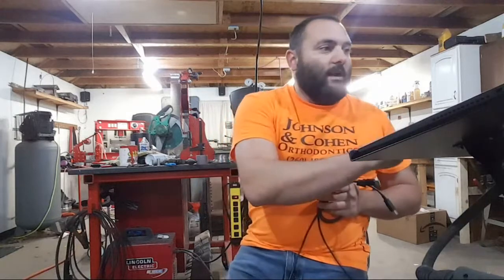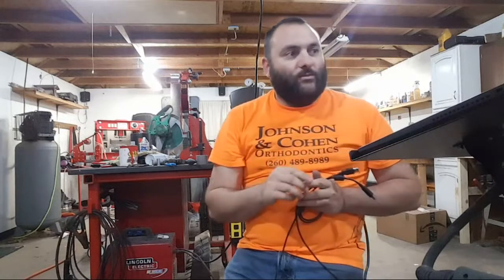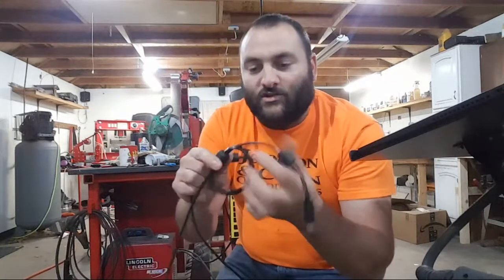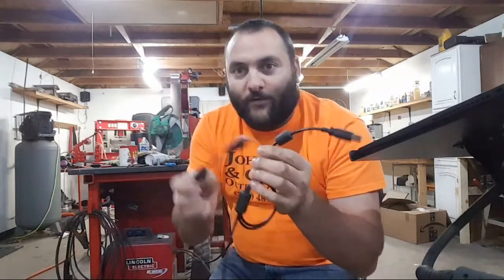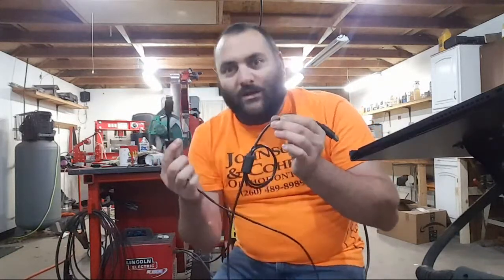It looks like we're starting to get somewhere here. Looks like Fire Control and Inventor pop up. Now, Inventor always takes a little bit to load when I'm in the shop because I don't have internet. Try USB ground loop isolator. They're cheap. Ferrite choke. Yes, the ferrite choke. That's different. Okay, so that's what these are, the ferrite chokes. And they gave me 2 of these. The fact that they gave me an additional one after it already had 2 of them on there, I started thinking, man, how much EMI is going to be coming back into my laptop if I'm supposed to be running 3 of these things?